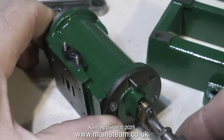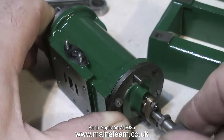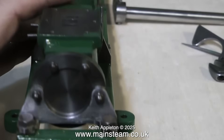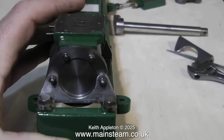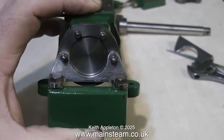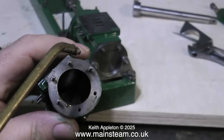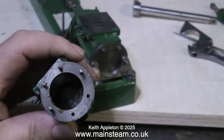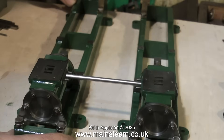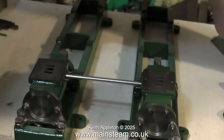In this shot you can see the studs are in place; the two missing ones at the bottom are for the countersunk bolts. Here is the cylinder with the covers attached — this is the one that I remachined, so it's good to see that it moves very freely with no binding, no tight spots, and it's parallel all the way. Here it is fitted to the engine. When building or replacing a cylinder on a Stuart Victoria, it is essential that the port face is perfectly in line with the base. If the cylinder is canted over in either direction, not only will the engine look bad, everything will be very out of line. So if you are building one from scratch, be very careful at the marking-out stage for the bolts that mount onto the angle bracket that you have to machine.